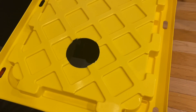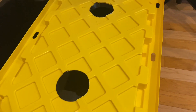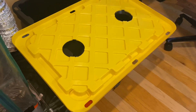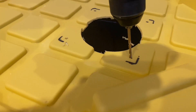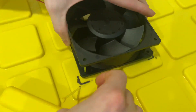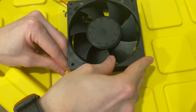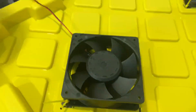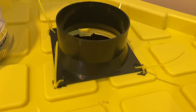So let's run through how I built it. I began by using a four-inch hole saw to drill two identical holes on the lid of the tote. I went ahead and traced the duct adapter's corners twice because its holes are located the same distance apart as the fans. I then drilled two holes at each corner so I can secure the fan and duct adapter with zip ties to the tote. I then repeated the same process for the duct adapter.